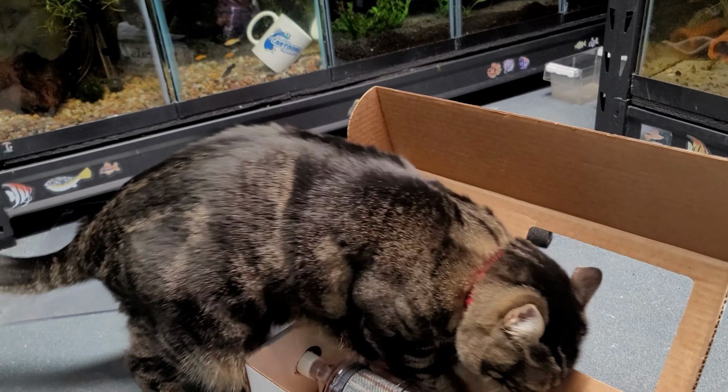Well, the ABS cement might not be set yet. But then that compromises your bond, right? By twisting it? Yeah. Like, it might not be set, but it is setting. It is set enough to where I can't twist it. But since it's just a drain and there's not going to be a lot of pressure on, how important is that ABS cement bond? Well, it could be the next leak. Yeah. Like, if I destroy that ABS bond and twist this and leave this, yeah, then that could leak. I'll just move the leak from the threads to the joint.